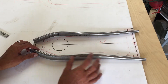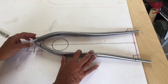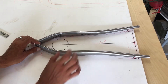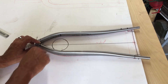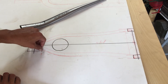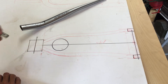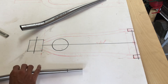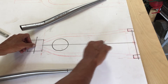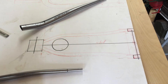I got my chain stay lines drawn out and basically did this to the shortest point I could. I started out with the axle and positioned everything up. I wanted just a little room on the edges — I don't want the tubes right up on the edge of the bottom bracket shell, I want the weld to melt off the corner of the shell. That came up to about a 422 millimeter center-to-center rear end length.